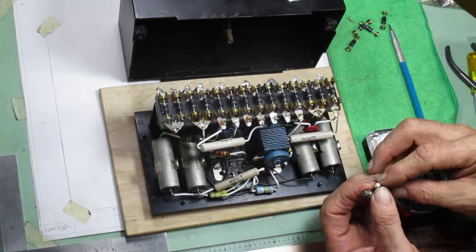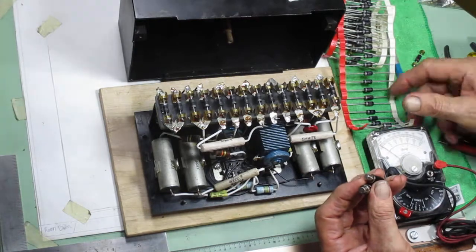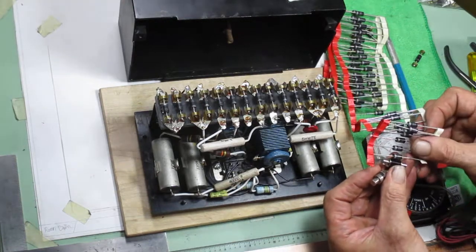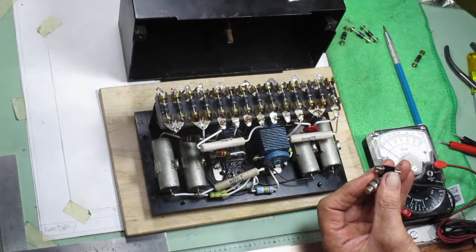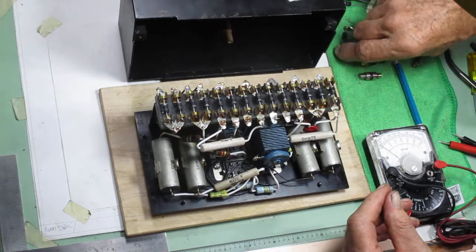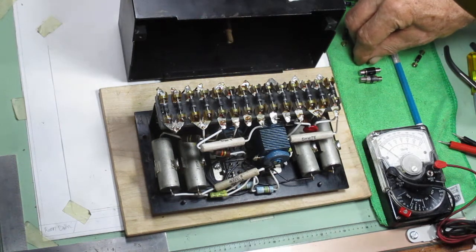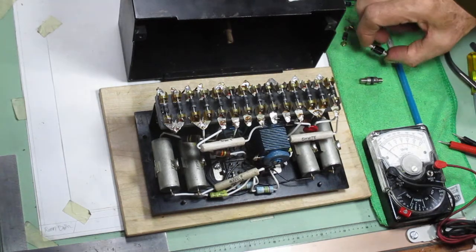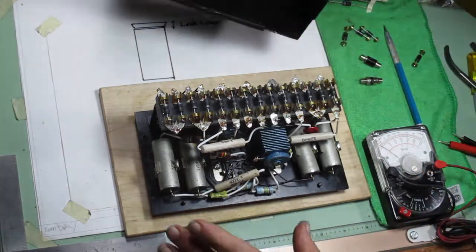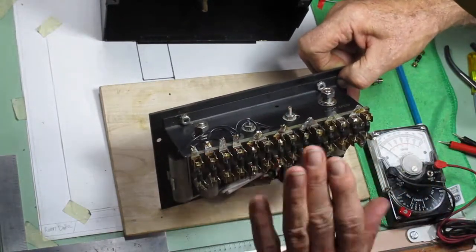Rectifier 2 has two diodes — these are the factory stock old diodes. They're regular diodes in a case, which kind of helps make them explosion-proof in case there are flammable fumes around. But under certain conditions, these things will go off like a firecracker — it'll blow that case apart and burn the inside. I want to caution you: if you're going to work on this with the cover off, wear safety glasses and don't touch anything when it's powered up. It'll shock the crap out of you.